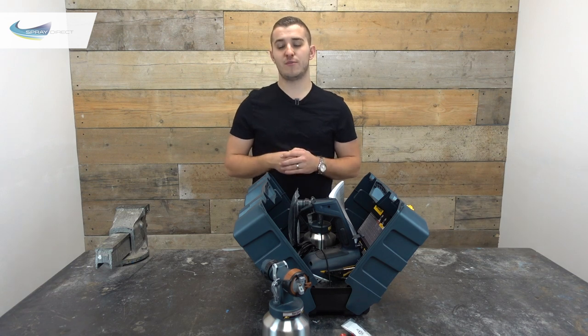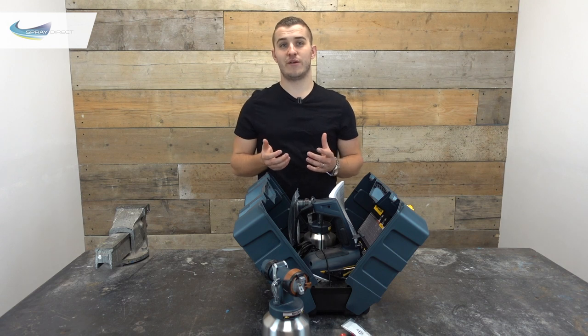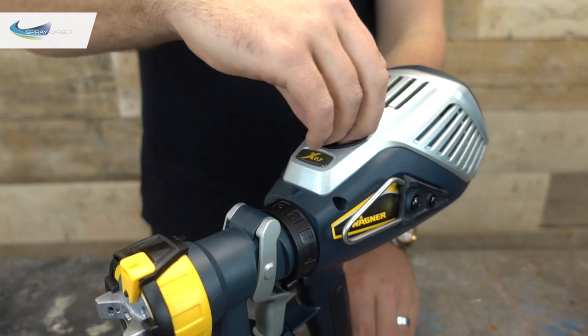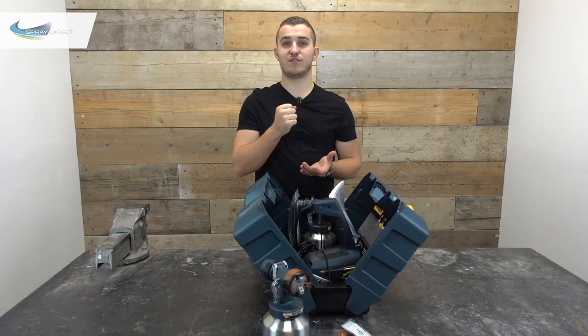The only things that aren't covered by the warranty are the front spray attachments. So these are considered to be a wearing part, and you could invalidate your warranty if there is paint found inside the turbine unit itself. So that tells us that either the filter hasn't been changed or if the unit has been tilted back too far and paint has backtracked from the pot.